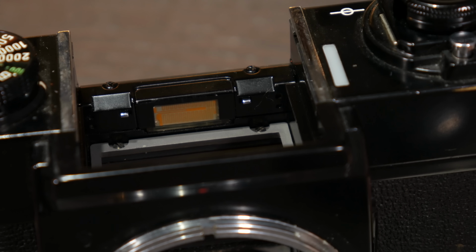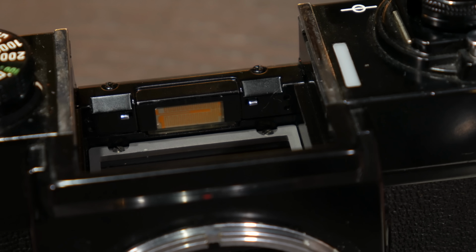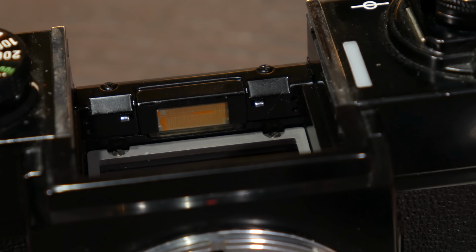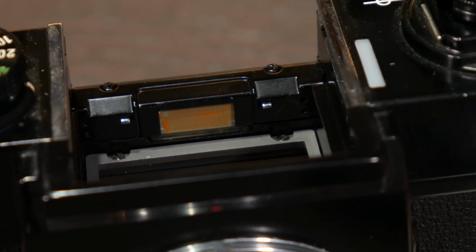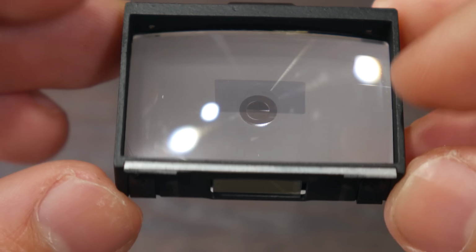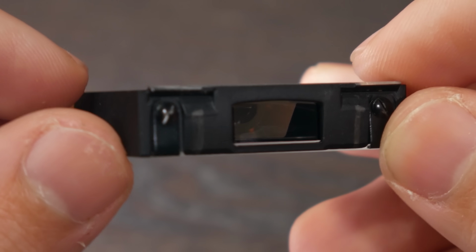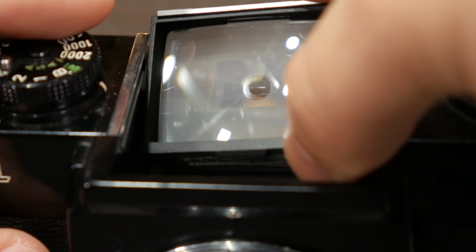The light sensor. From the looks of it, it seems to be a simple light-dependent resistor, or LDR, though it's obviously a little fancier than the one in your garden variety nightlight. The amount of light that falls on this will, thanks to the battery and the simple electronics it powers, determine where the needle in the meter lands. So, in the end, that rectangle is simply the dark region left by a semi-transparent mirror embedded in the glass of the focusing screen at a 45-degree angle so it can redirect a portion of the light onto the sensor. That's what I call neat.